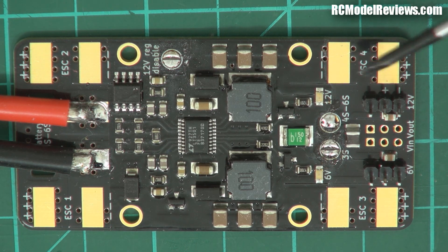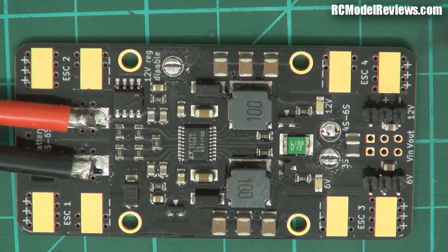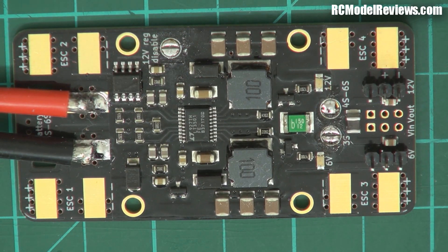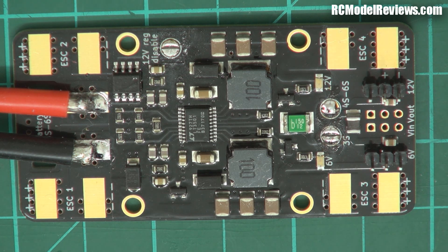As you can see, these are gold plated — and why is that important? Well, not only does it look good but it makes it really easy to solder to. They could have made them just bare copper, in which case it tarnishes pretty quickly and can be hard to solder to. They could have tinned it, but again solder oxidises pretty quickly too, so even a tinned land would sometimes be harder to solder to. So they went for gold — and they succeeded.